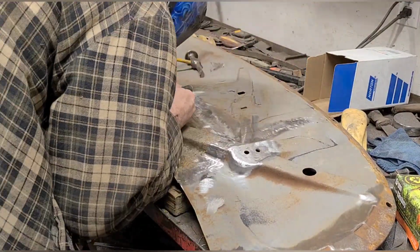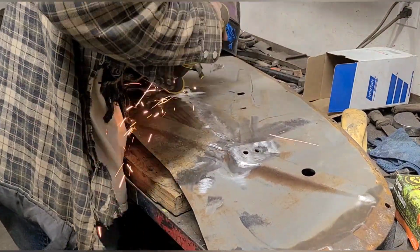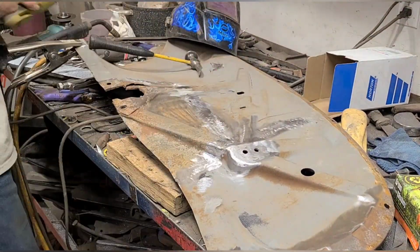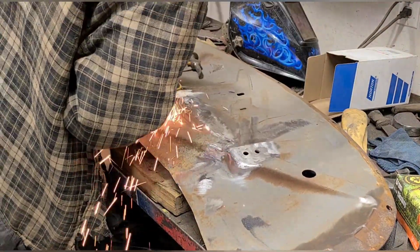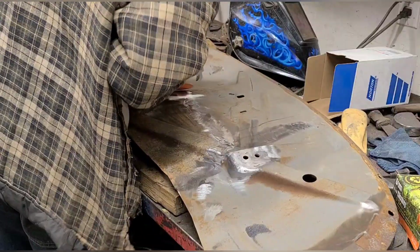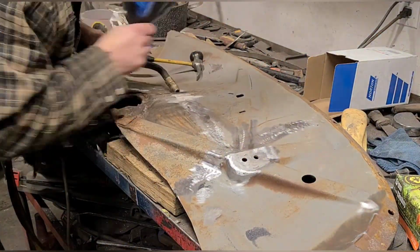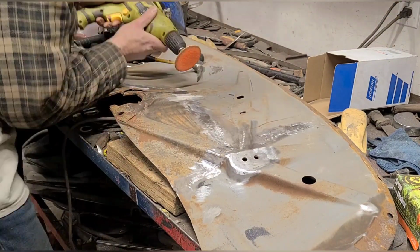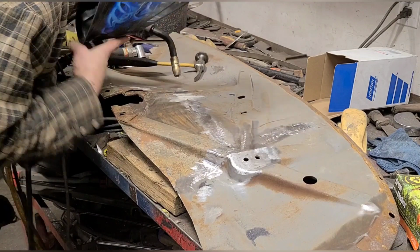Originally, I wrote it off because, as I'm sure it's doing for you, it kind of goes against all the traditional theories of, oh, you don't want to warp it. Like I said, it's going to warp no matter what, but welding it slowly is kind of an approved method and certainly still valid. Obviously quite tedious, but it's a good way of minimizing your warpage.